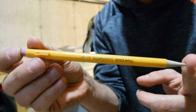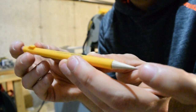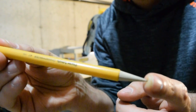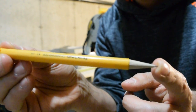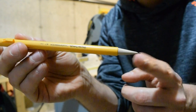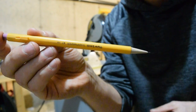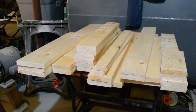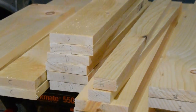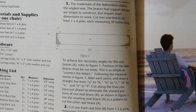I'm a big fan of these PaperMate Sharp Writer pencils and I use them for a lot of things including woodworking. The nice thing that most people don't realize is that they are spring-loaded on the ends, so they work really well for marking wood — even rough wood — and the lead won't break. They're relatively inexpensive and available pretty much anywhere. I've got all of the boards cut to length and stacked up. I've put letters on the ends of each board corresponding to the letters in the cutting chart in the book. Now I can get started with Step 1.